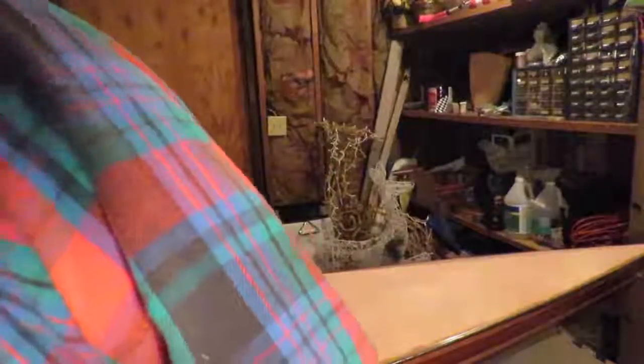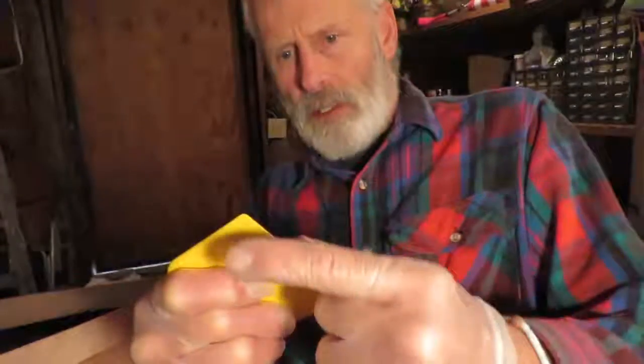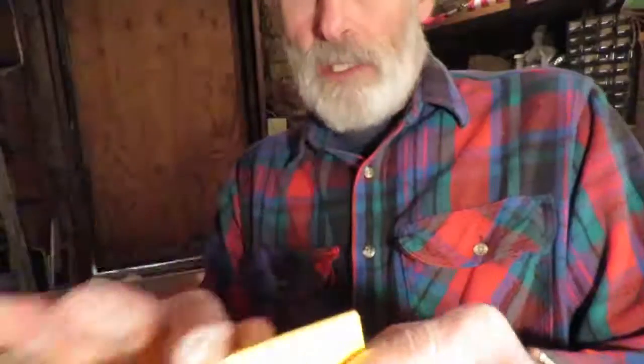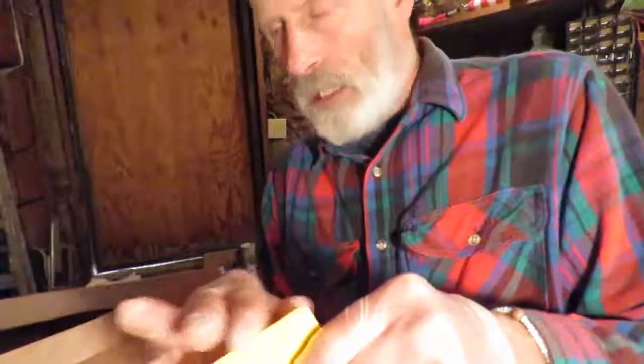Okay, so we'll want a clean squeegee for the job this morning. Run your finger along the edge of the clean squeegee. Make sure it's totally clean. If you have just one little bump of epoxy on the edge of your squeegee, every time you drag your squeegee over the new epoxy, it's going to create a groove in the epoxy and an uneven surface. So make sure your squeegee edge is perfect.